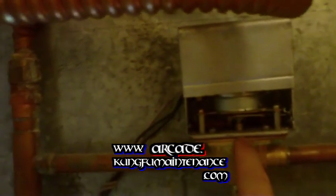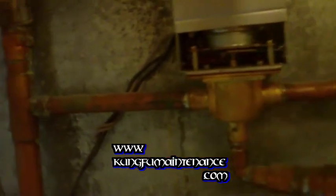You can sometimes replace these zone valves, but again it depends on the conditions of your area. Out here the water is hard on these particular zone valves, and so most of these have just gone with manual shutoffs.